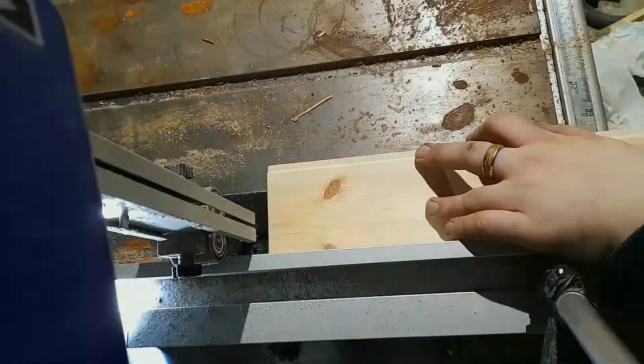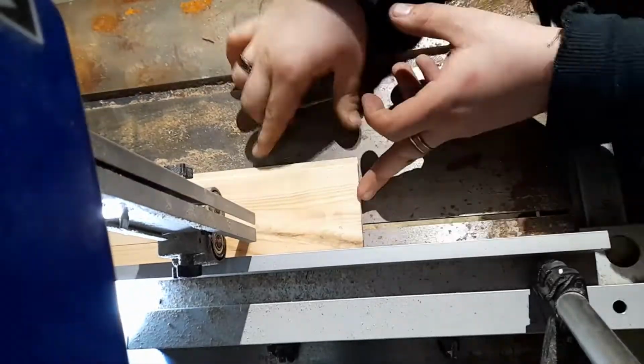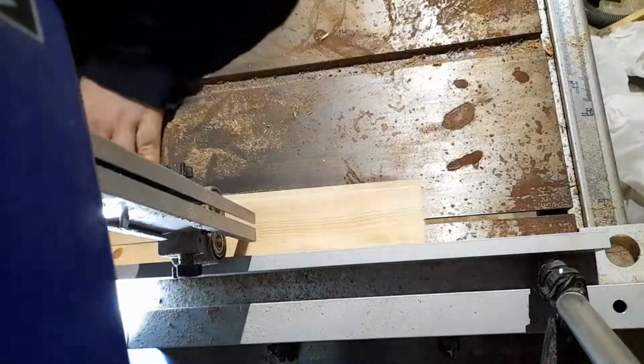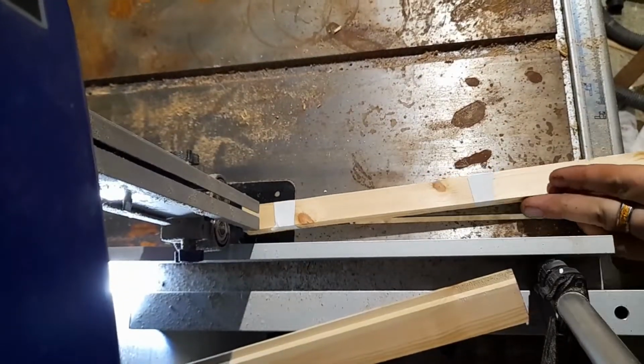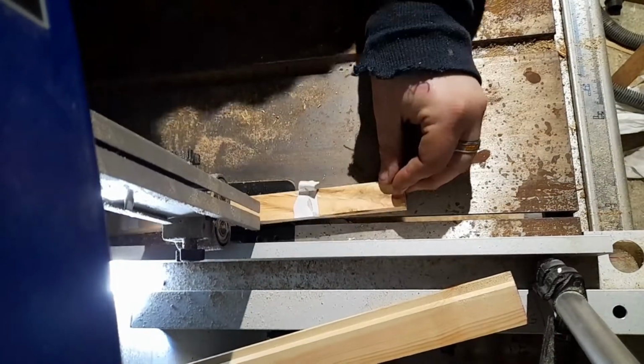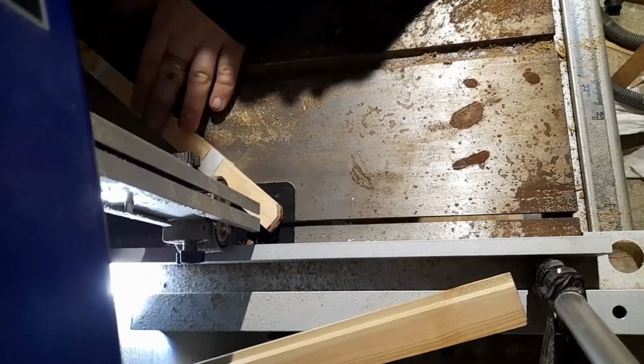So I start here by stripping these off to the inch width that I want, and then because at the end I want 2 matching pieces, I tape them together to further cut the angles on the side and the dome on the top. This just helps with marking so you have less interference.